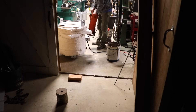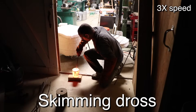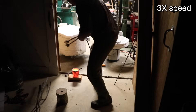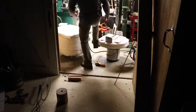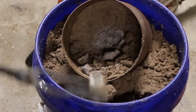I'm preheating my brass with a propane torch just so it doesn't lower the temperature of the melt too much. Let's see if I can manage this before it gets too cold to pour — you have to work kind of fast when you have a small amount of metal like this. Unfortunately I waited too long. So I put the remaining metal back in the crucible and back in the kiln, then dug out the small ingot I did manage to pour — it was too small for testing — and added it back to the crucible as well.